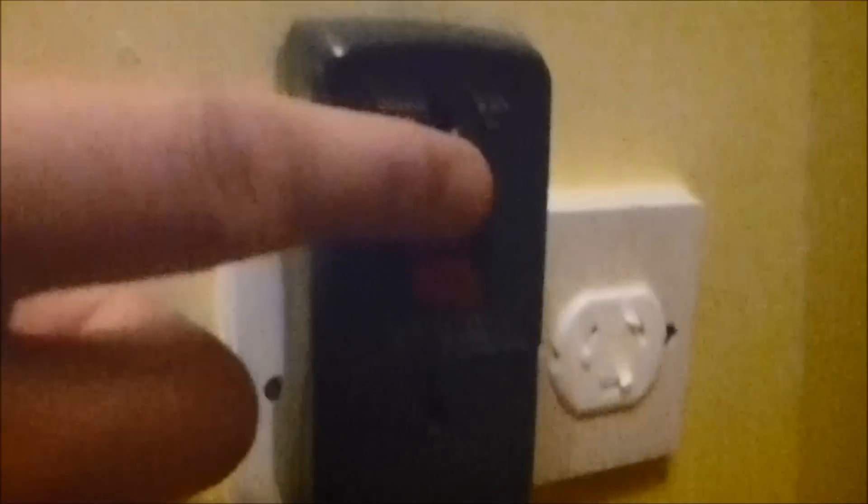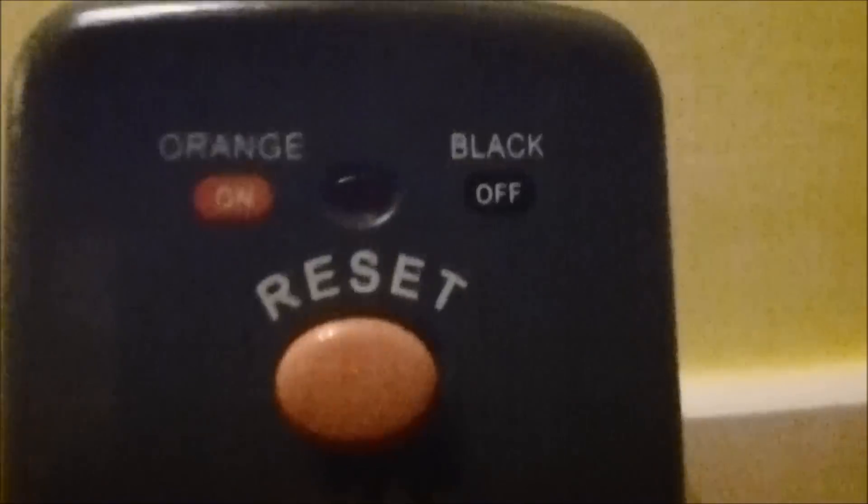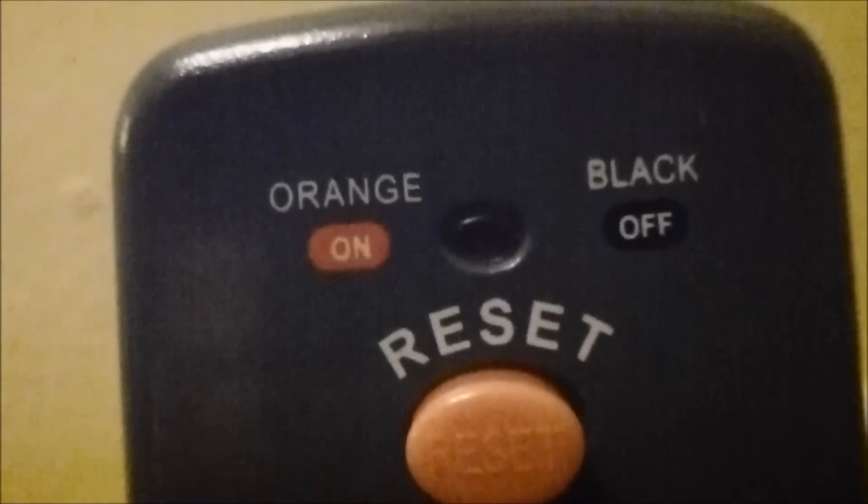To make sure we're safe, we're going to test our RCD. When you plug it in it normally has a test feature — press it and it will click, confirming it's working, and then the reset button will let you know it's working properly. Read the manual for your own RCD as they're all a little bit different, and make sure you follow the instructions carefully.